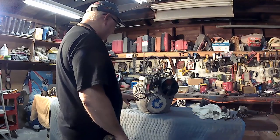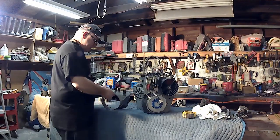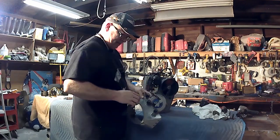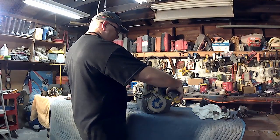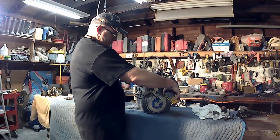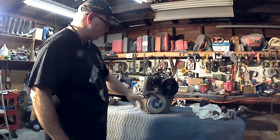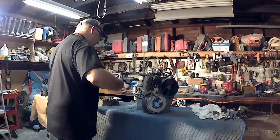So at 3 1/2, the old CDIs, let's see if that's correct. Yeah, the old CDI sat right there. And there was a big box that came right off the back of that. And I remember having about 1 inch worth of clearance off of the firewall. And this intake right here appears to be about right at 1/2 inch to 9/16 out. So I think we should be able to put this on without any clearance issues of having to move the motor forward or to cut into the firewall.